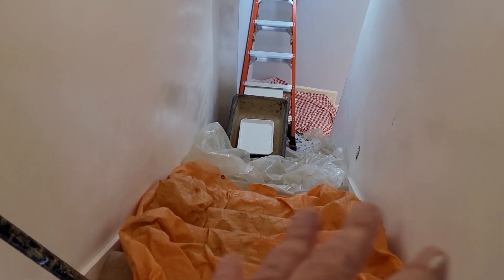Other than that, it's just pretty straightforward. My order of painting is ceiling, then walls, and then the trim — at least in this hallway area. And that way I can do an edge. I've got a pad I can use for edging with the wall paint.